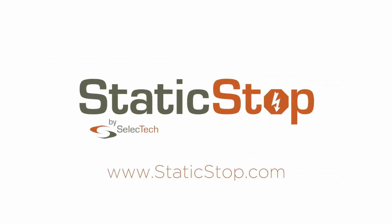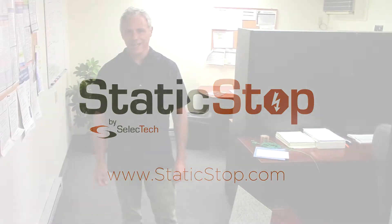One question we get asked a lot is how do you ground the floor? To us it's pretty simple - it's what you do at the end of the job. The properties of the product are more important, but grounding the floor is essential because you need a path to ground. The charge goes from your body into your shoes, if you have appropriate shoes on, into the floor, and then it makes its way to ground. So if the floor is not grounded, you don't have a complete system.